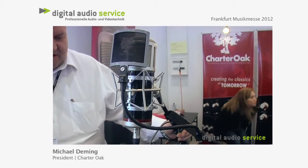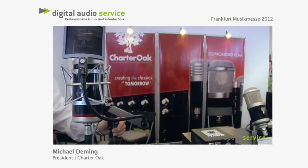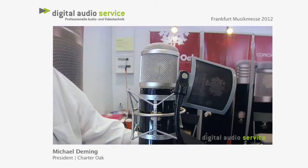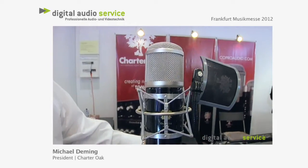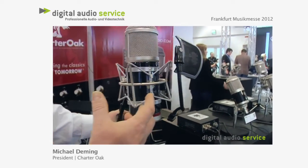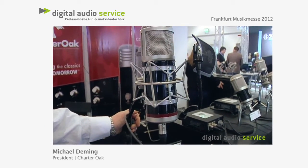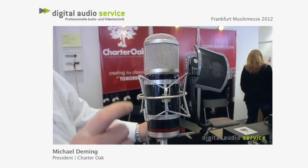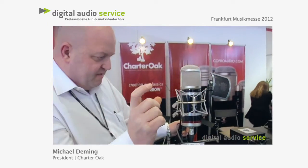You notice the microphone's very large. We use very high voltage on the head amplifier — we can take this away and show you. As a result, you have very large components inside: one microfarad polypropylene capacitors that have a 630-volt rating. Those are very, very large and stand high up off the circuit card.